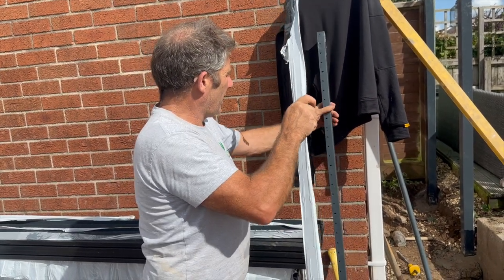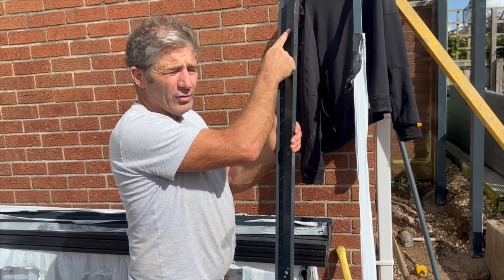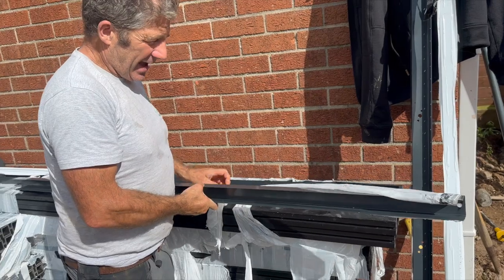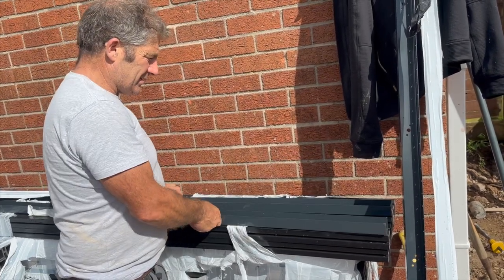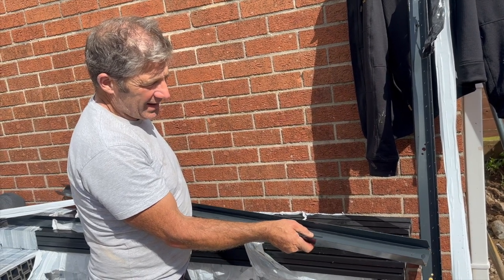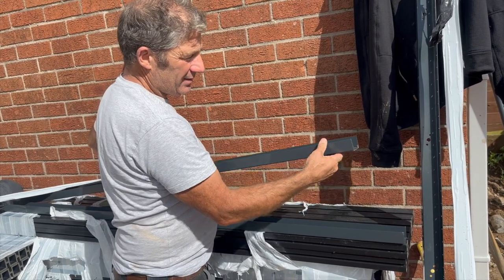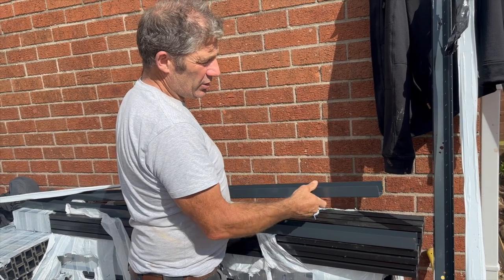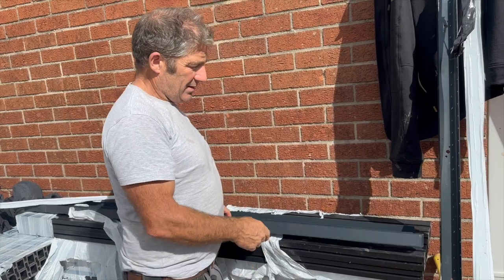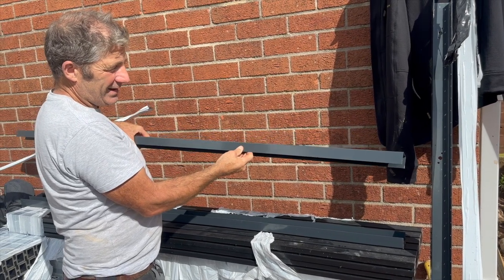The other thing is that if you're not fixing this to a post, you are fixing it onto a wall — that's what those holes are for. Now if you look at these, this is the header and the footer, or the base plate and the top plate. Looking at the base plate, they've got holes in here to allow the water to run through it, so your composite isn't sat in water. These go in between your H-posts — they slide in, then you fix through your H-posts ensuring a good fix, and then with your H-posts coming up there are holes in there and you fix your composite all the way up. Eventually the top plate will sit on top of your composite, just giving it that nice finished look. Quite clean, smart, and contemporary.